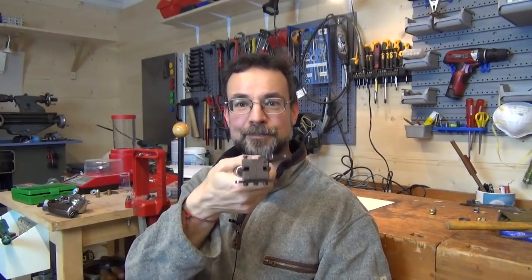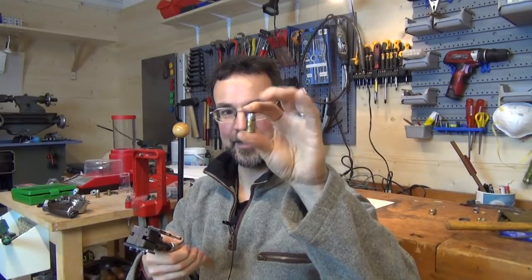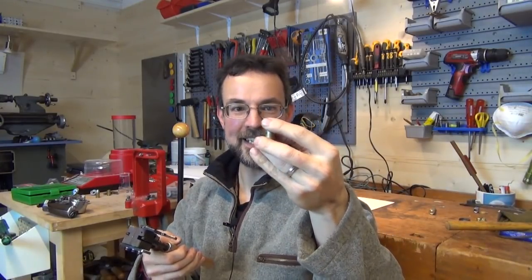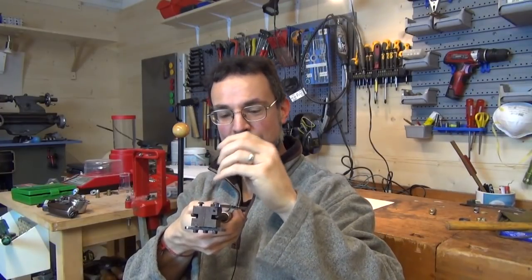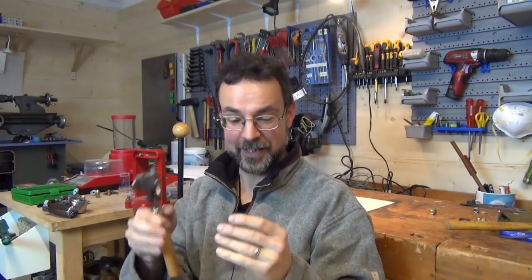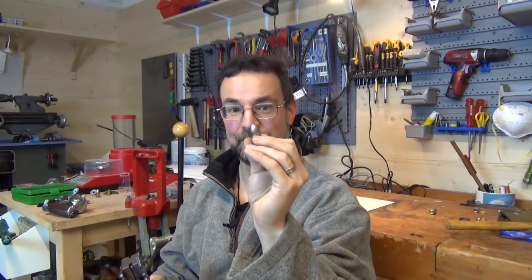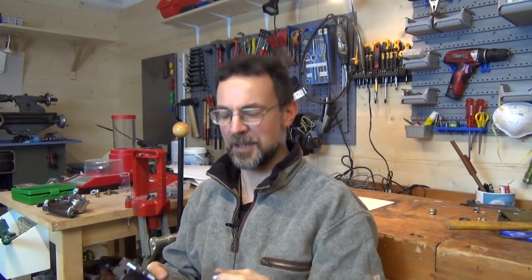So what are the solutions? Well, option 1 is to make yourself something that looks a little bit like a bullet mold, with the cavity sized to the cartridge, to the case here, and you leave an internal shoulder just at the top, so that when you close the 2 halves of the tool, it crimps. You get an annular crimp just at the right spot, which is great, but you really need to be quite precise with your measurements to do that.